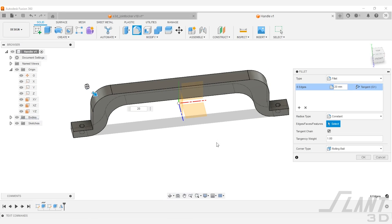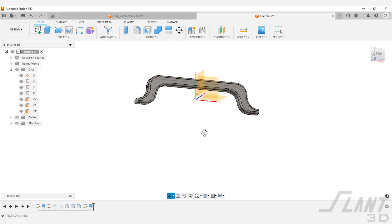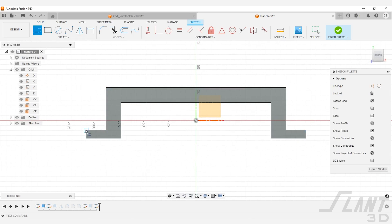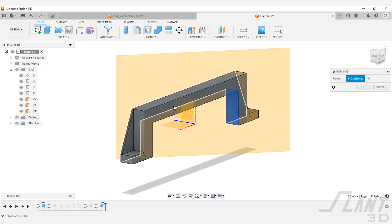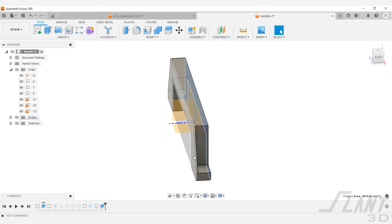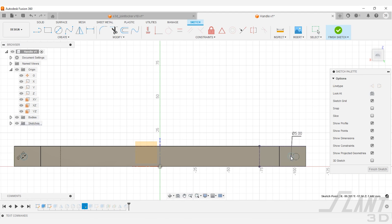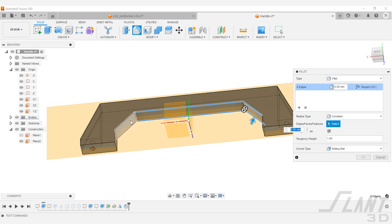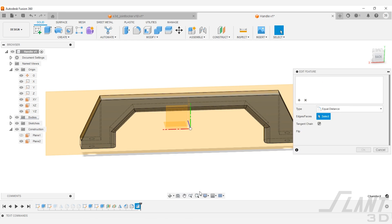You can't simply do a standard handle where you round off the edges and drill a hole in it. It's not a piece of bent steel — it has different structural needs, so you have to design around those. One of the simplest solutions is to use chamfers and create ribs around where the holes are. These ribs don't require much support material, can be easily mass produced, and leave room for the hole and screw head. You can fillet the edges so it has a nice smooth feel and no sharp edges.